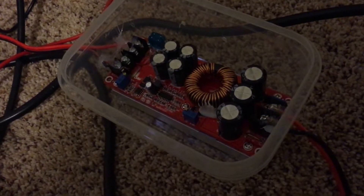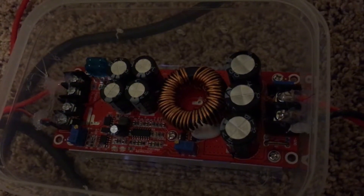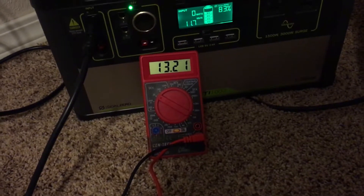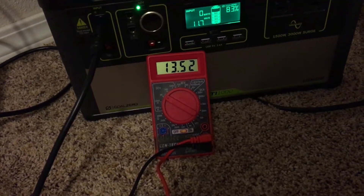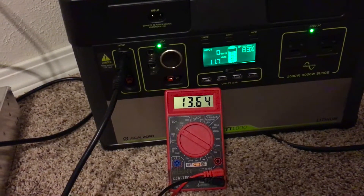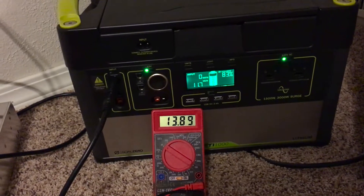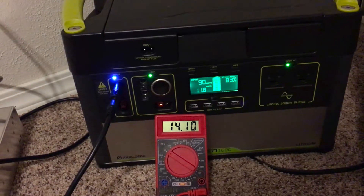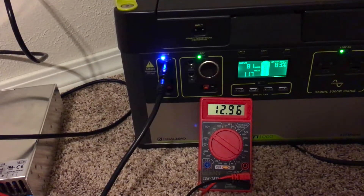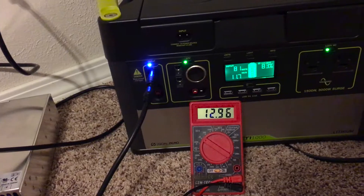That's exactly what we're going to do with this module I bought off eBay — just search '1200 watt DC-DC boost converter' and you'll find it for about ten or eleven dollars. So we're at 13.2 volts. Some alternators go as high as 14.4 or 14.6 volts. Interestingly, around that 14.6 mark the PWM controller will come on. On mine it actually came on right at 13.94 volts — so if you had 14 volts from your car's alternator it may work.